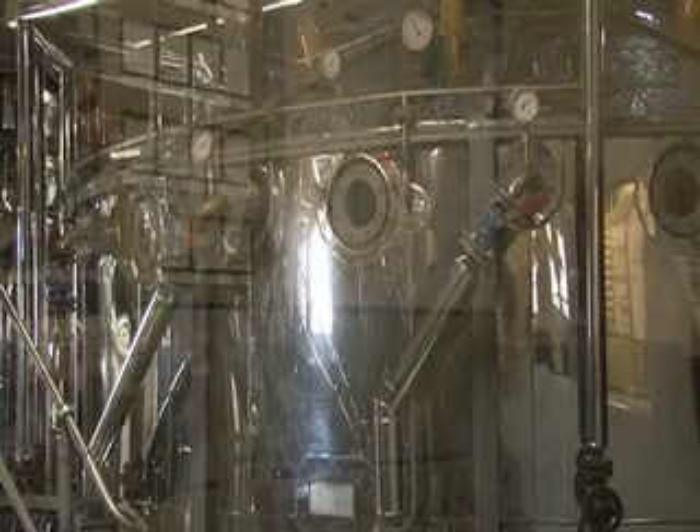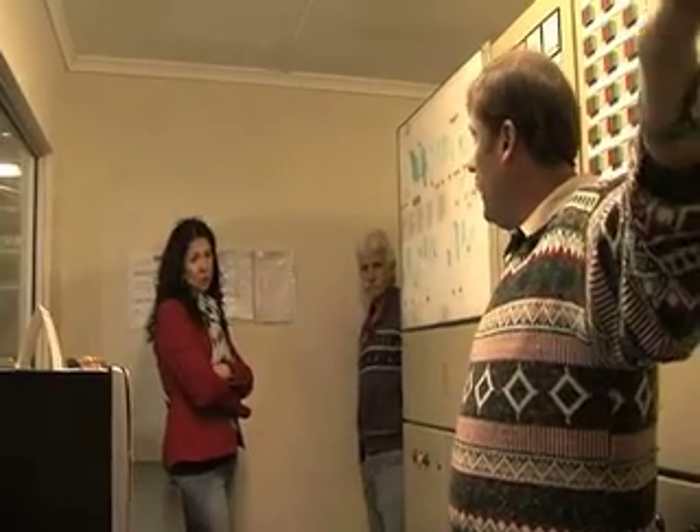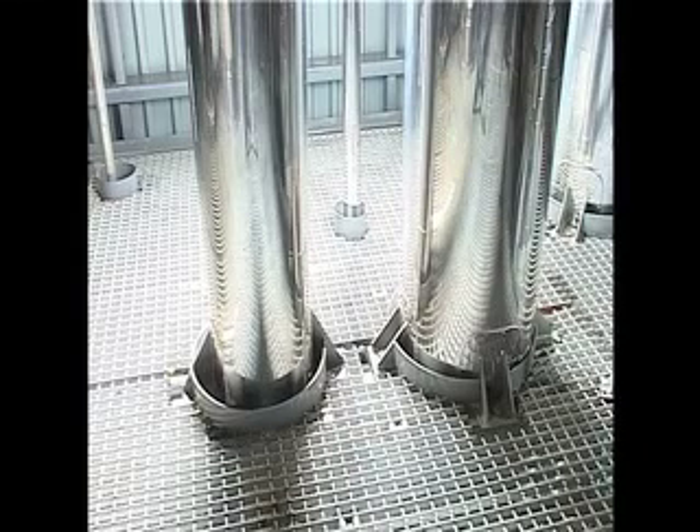The rest of the process goes further to the distillation unit. We take the extracted oil and hexane mixture, which is called micella, and pump it into distillation columns where we slowly heat it up under high vacuum. The hexane is then pulled off with a vacuum into a condenser, cooled down, and fed back into the plant, right up to the last stage where we add live steam also under vacuum to strip the last bit of hexane.